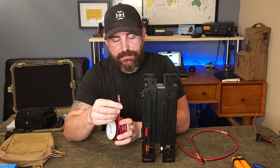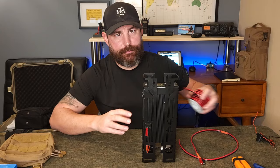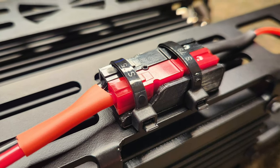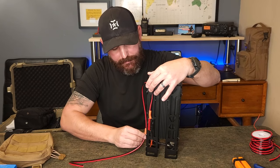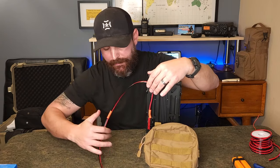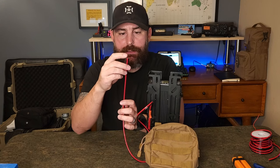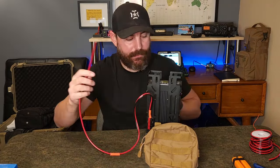I had some 14-gauge zip cord from PowerWerx and decided to use it for the next portion of this build. This is way over-gauged for the 8 amps we're going to pull on the top end, but I basically cut the wire to the length I needed and mated it in place. Since I don't have the cable pass-throughs like I have in my normal TTP man pack, the cable is going to have to come up and go through the bag, run outside, and then go into the admin pouch on the front. I cut it just a little bit long so I can dress it up. One tip: if you're going to use heat shrink, make sure you put it on first. I use zip cord because it keeps the leads together, then add a little bit of heat shrink to keep them together where I cut the pieces down to put the connectors and housing on.